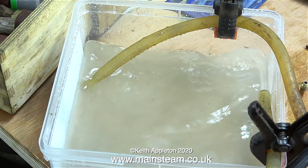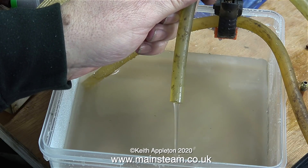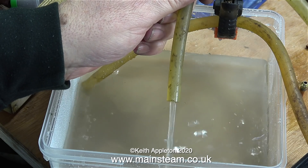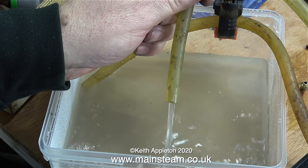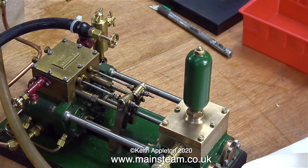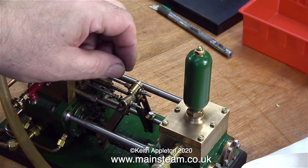The adjustment of the timing of the pump isn't perfect — I'm going to look into that in the next episode. Everything appears to be fine. This pump is double acting, so the piston not only draws in new water, it simultaneously pushes out the water from the previous load. And as this is a duplex pump you multiply that by two because there are two water cylinders both double acting.